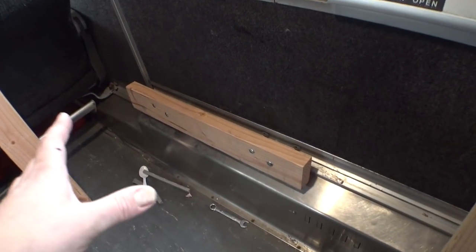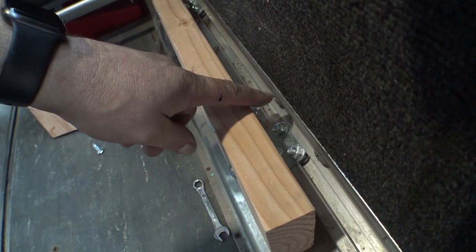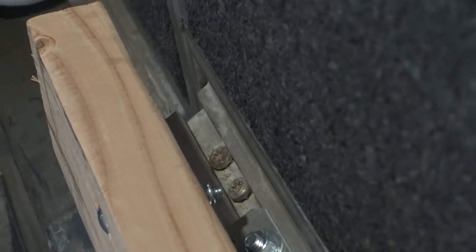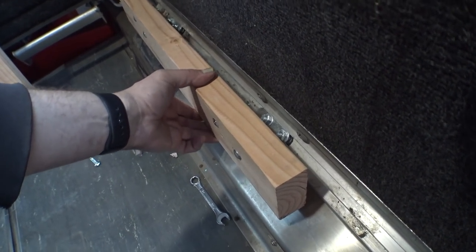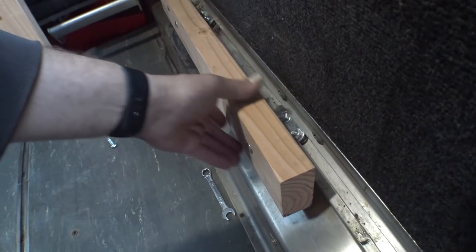So, this is our wall mount board that the desk is going to attach to in assorted ways. As you can see here, we've got some brackets in the back, and those pick up this rail. By the way, I just wound up taking out these 2 screws and sliding my bolts in, and then putting them back in there. These things bolt on here, which attaches this board on, but as you can see, it's a little bit flexible, because we're just using Simpson corner ties that I bent to an angle to get this roughly straight up and down.